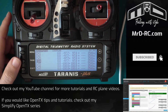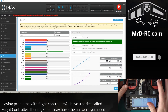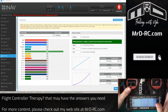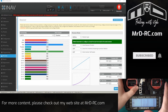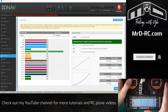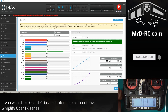So now going back to the desktop: all the way left is 1000, all the way right is 2000, down is 1000, up is 2000, yaw left is 1000, yaw right is 2000, throttle all the way down is 1000, all the way up is 2000, and 1500 is the midpoint. That's how you set up your receiver in iNav.